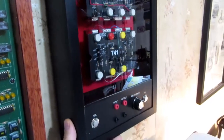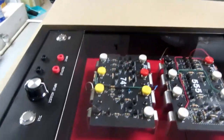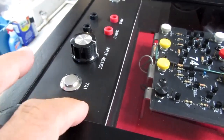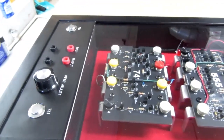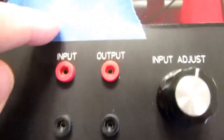Okay, I'm just gonna take this guy off the wall with its magnetic hanger. I was trying to remember and remind myself how this was built, and so it has the acrylic window that just covers the entire thing, and then it has glued onto that a 16th inch thick aluminum panel for strength, and then the printed overlay glued onto that. So that's all essentially part of the acrylic panel then. I'm obviously going to have to replace the acrylic panel in order to do any changes to this area, and that's okay.